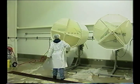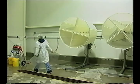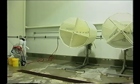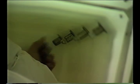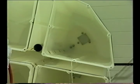In order to properly conduct cleaning and sanitizing activities and to maximize the effectiveness of those activities, there is an order in which those activities should be conducted. First, any equipment that needs to be disassembled prior to cleaning should be taken apart. All surfaces should then receive a pre-rinse with potable water.